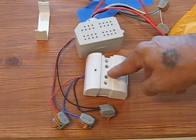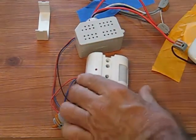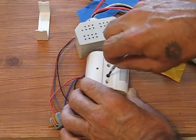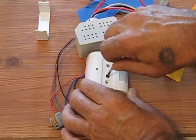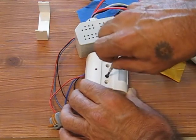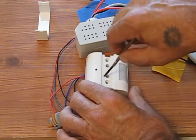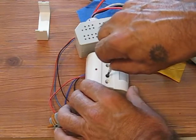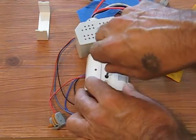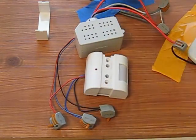Give me a sec to turn this thing down to its shortest timeout and we'll turn it on. I am going to gently — and that is gently with an exclamation point — feel where the time adjustment is. It was turned all the way up. I'm going to turn it all the way down very carefully, feeling when it stops. These only turn one-half to two-thirds. If you take them any further than that, you will have broken the adjustment.